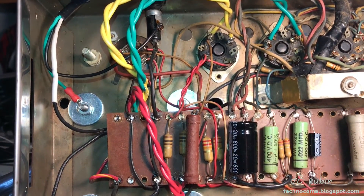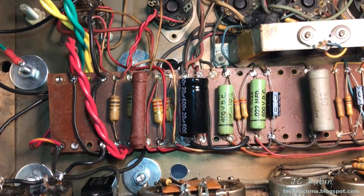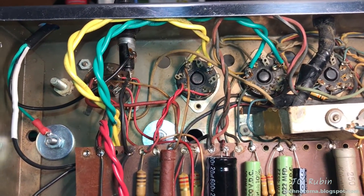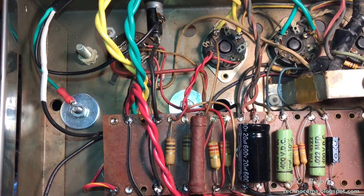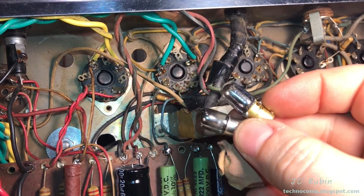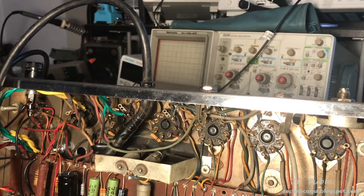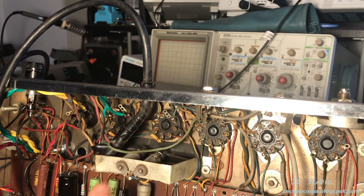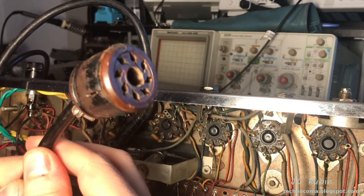Everything is complete and cleaned up. I've gone through the other wires as well, all the components are laid out very nicely. I'm going to fire up and test everything again since I've touched all sorts of connections. The power supply section came out pretty good. I further complemented this with the replacement of both bulbs, which were both burned out, with brand new bulbs. Having already dealt with the problems from this standby switch and the wiring earlier, there's something about this cable that says 'don't trust me' - and I'm listening.